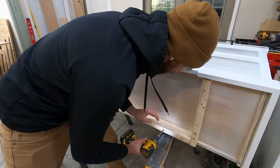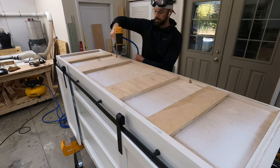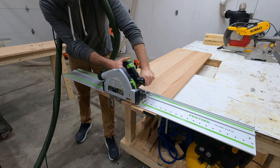Because only the outside portion of the face frame was touching the ground, I wanted to reinforce the bottom of the cabinet, so I milled up some 2x4 pieces and attached them to the bottom with screws. For some extra support on the top, I secured some scrap plywood into place — and that's the reason we left a three-quarter inch gap at the beginning, so all of that scrap plywood would fit right down in there and be flush underneath the actual top.